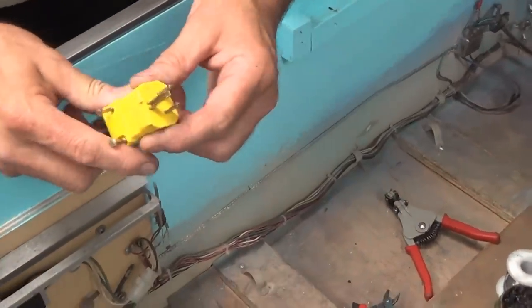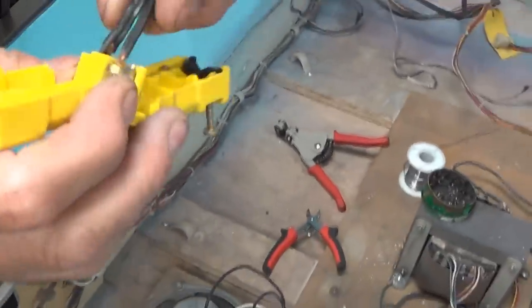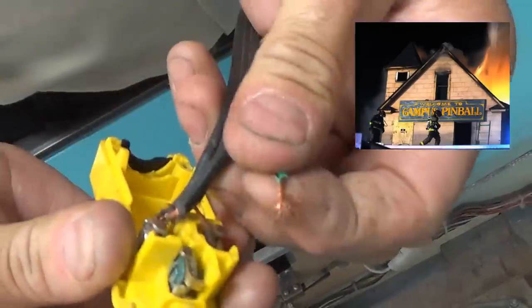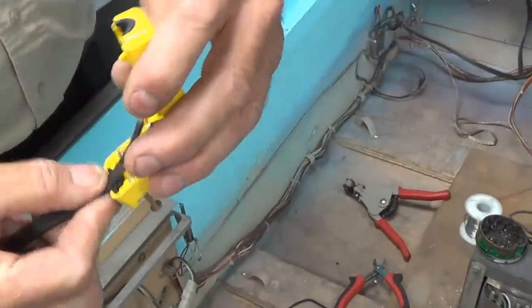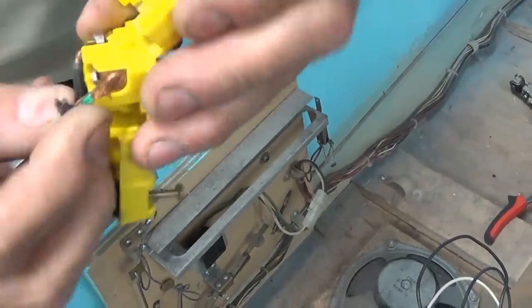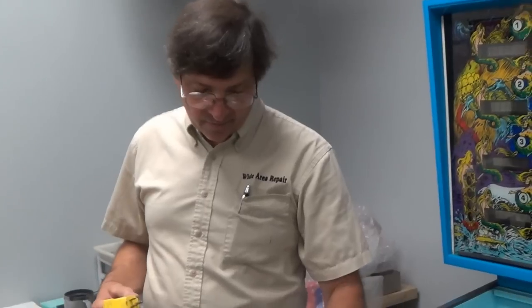We were at that auction and I was trying to plug in games and I was ripping out people's stuff who had the round ones taking up two spots. This is made by Hubbell. These things are like $9 a piece — they're very nice the way they break away and split, easy to do a nice job. However, this person left half the conductors not even going to the terminal, and the ground — I don't think they really have anything hardly going there, and it is loose. People that do this kind of work don't generally do quality. So that's why you really don't want to deal with these anyway, because a molded cord is much cleaner, nicer, and it doesn't take up a line strip.